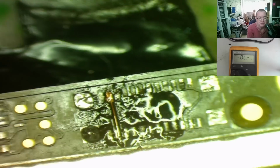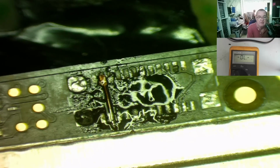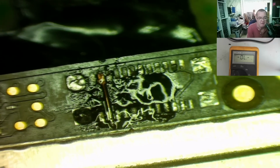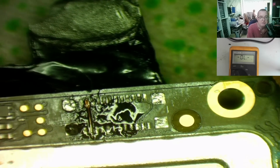Okay, once I've stuck these down with some solder mask, I can actually then just retin these a little bit without worrying about the thing coming off. So I'll go along here and just fit the rest of them, and then we can see how it looks. Okay guys, I'm sorry if that went out of shot. It's so difficult to keep this in shot for you when I'm on the sort of magnification. You can see that stuck on okay. In the end I went right-handed with the tweezers, left-handed with the soldering iron. I am right-handed naturally. So I'll now fit the other ones, and then we can hold these down with some UV solder mask, and then I can always re-solder any of them that I'm not happy with. But first of all, let me get them all fitted.